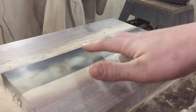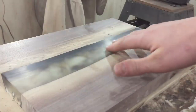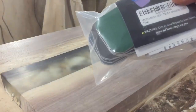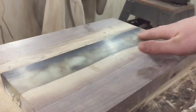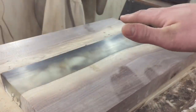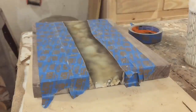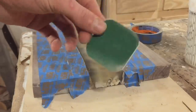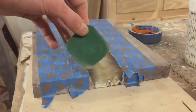What we need to start doing now is polishing up our epoxy. You can see just from the 1000 grit paper it's already kind of shiny, but we're going to use this micro mesh — the link will be in the description down below to the exact product I use — to polish this epoxy hopefully to a glassy shine. I've got my board all masked off, just to keep water from getting all over this gorgeous walnut and raising the grain. We're going to start off with the roughest grit of micro mesh — this is the green — and now we're just going to get to wet sanding.